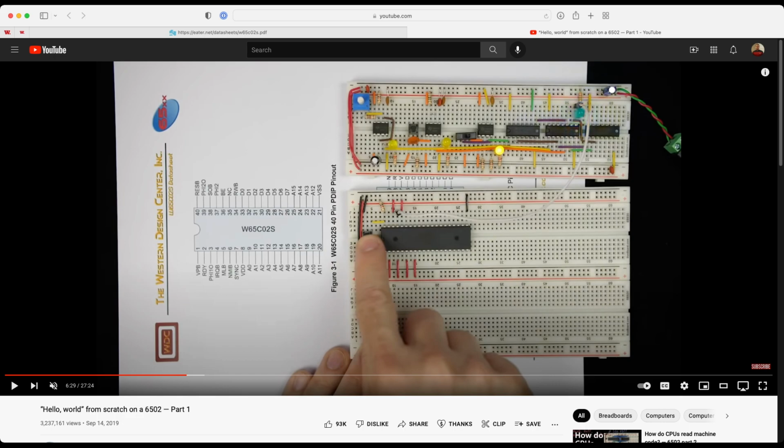Let me add the clock module on here. Just the one. In terms of keeping this circuit self-contained, we only realize that one output goes from that to pin 37. Yes, a single thing to pin 37 from your clock module circuit, other than power and ground. Right, because here I need to tie the clock module's power and ground to the rest of the circuit's power and ground, like with these wires here.